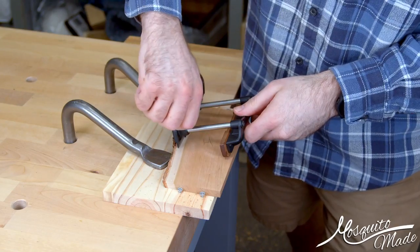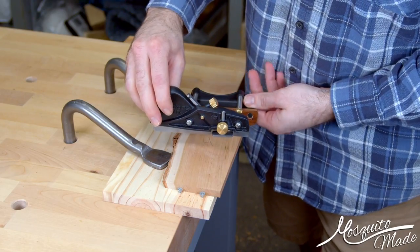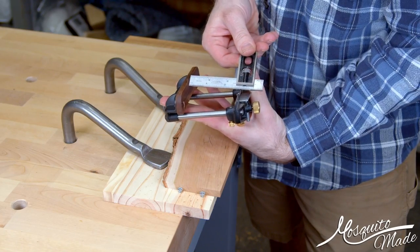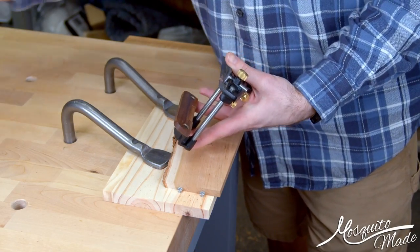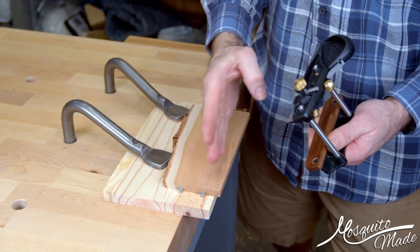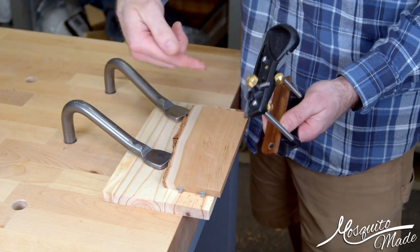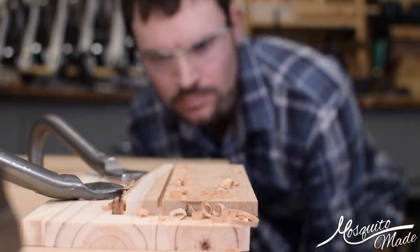What I've got set up here is kind of a unique opportunity. I don't know how often this will actually come up, but I am pretty much right at the extent of what I can have for the actual cutting width — from the fence to the center of the cutter, I believe it's close to about 3 inches is pretty much where it maxes out. What I'm doing here is I'm wanting to cut a groove that's parallel to the bottom, but close to this top edge. But because this top edge is live edge, obviously I can't reference off of that with a straight fence, because the line won't quite work.